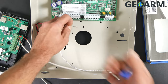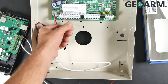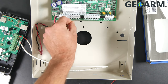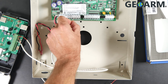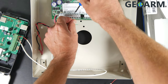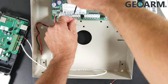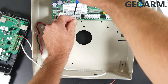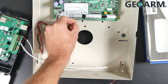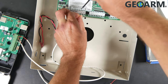Now you're going to see the last two remaining wires from this strip of four conductor — in this case, white and green. Take the white wire, which is sometimes yellow in these four conductor strands, and wire it to yellow — so white or yellow to YEL of the actual panel itself. Once you get that tightened down, go ahead and grab the green wire, and that's going to go into GRN. Then tighten it down.